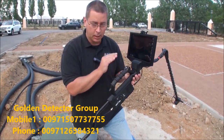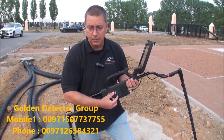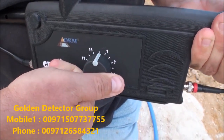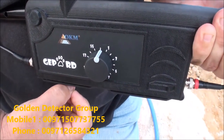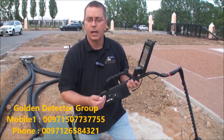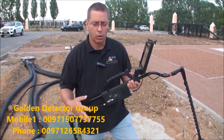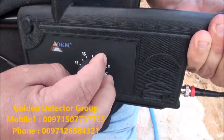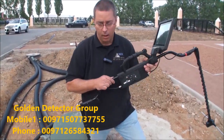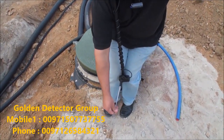We want to ensure that our depth gauge is properly set. On setting 1, it detects a very shallow depth. If changed all the way to the maximum — 16 — this will be the most depth possible, and we can see as far down as 40 meters in optimum soil, such as granite or sandstone with minimal mineralization. For this example I am going to set the depth control to about 3, and then check my antenna. I want to extend my antennas out to about three notches.